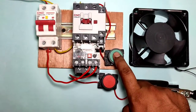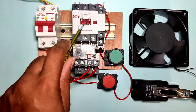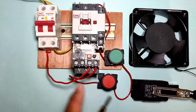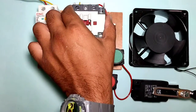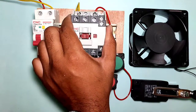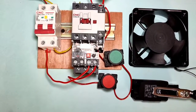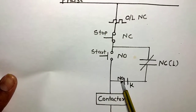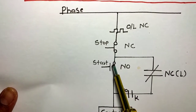When you press the start push button, your contactor runs manually. Now learn how to provide holding supply and how the motor starter should stop when the limit switch operates. For holding supply, we connect one connector from the contactor A1 coil to the contactor NO point — this is the holding supply connection we always do. We connect the contactor coil A1 terminal to the contactor NO terminal.